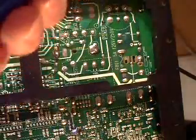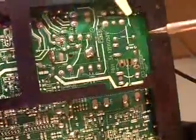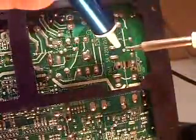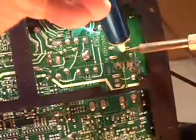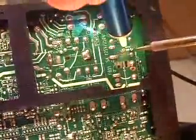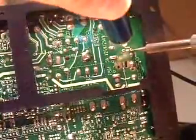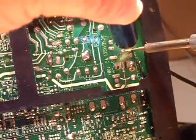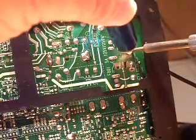I got the lead out, and now I want to use the one-handed solder sucker I just bought. You load it up like that, then you start sucking — you melt the solder and suck it up. It's probably better from the other side of the board, but I'm just showing you what you do. That one actually worked good.